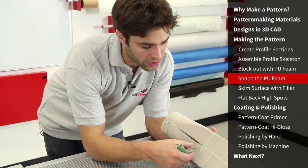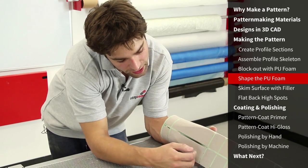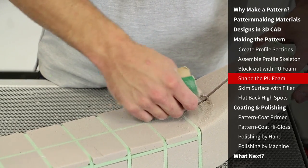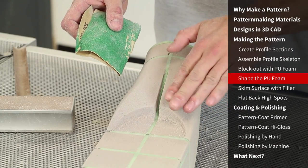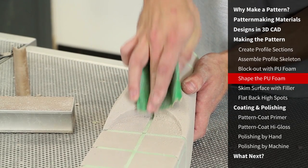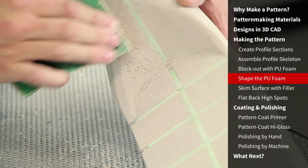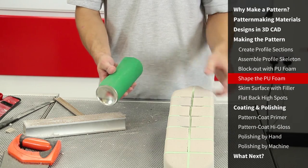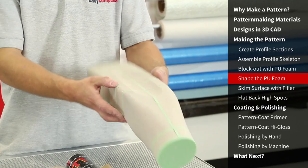This area on the underside of the pattern is a little more tricky. The underside of the airbox should continue flat and finish with an arc radius. I have no templates to work to in this area, so I'm going to pretty much do it by eye. But with careful sanding and taking my time, it shouldn't be too difficult. Where the pattern drops away, that indicates a scoop in the original shape, so I've referred to the drawing and I'm shaping it by eye to form the originally designed profile. We're now moving on to sanding the finer details — the radiuses around the edge of the pattern. We've left these till the end because otherwise they're very fragile, and we've improvised radius sanding tools to allow us to take the scoop out of the top of the pattern.